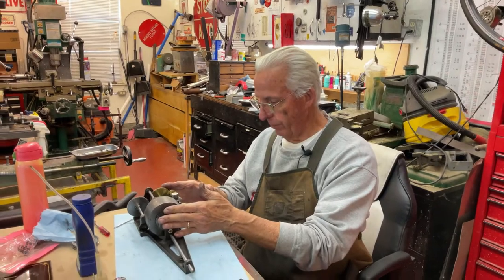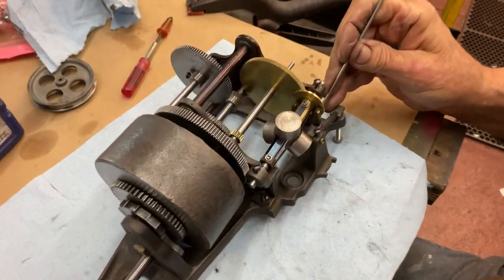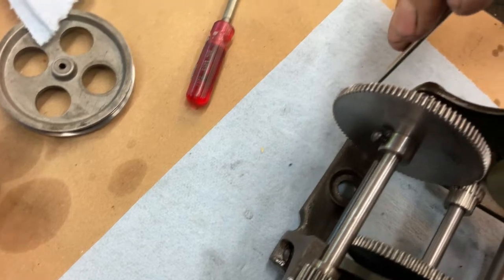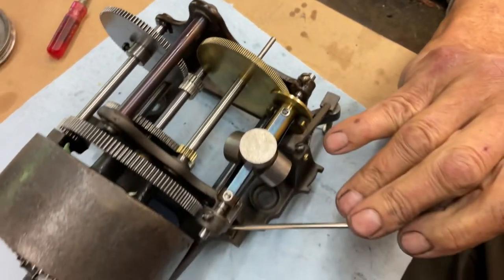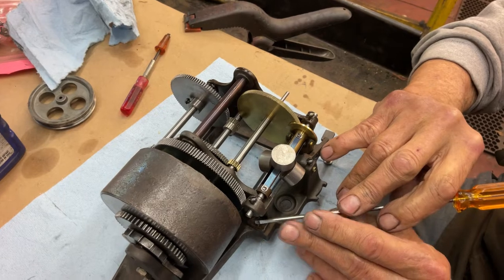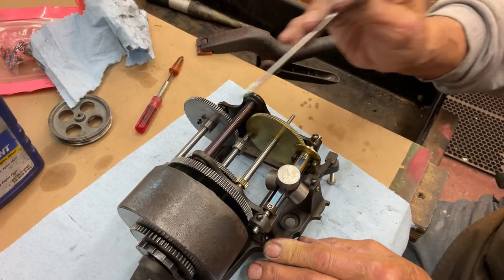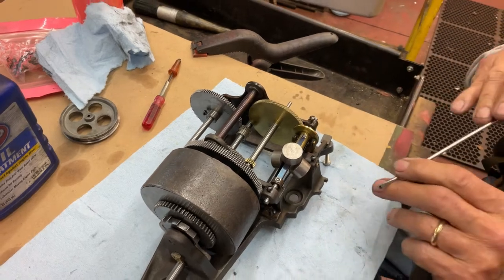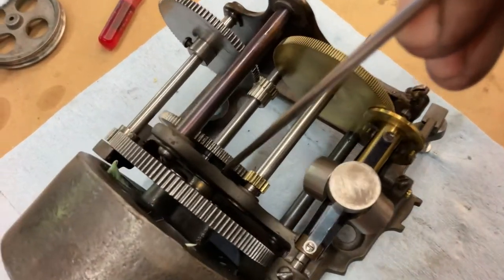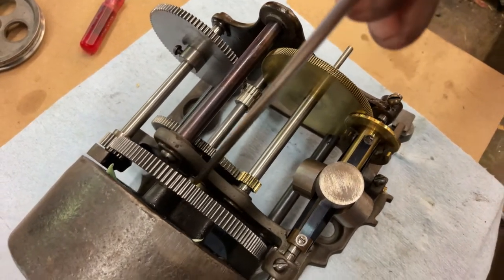When you put everything together and have to put the four screws in, you want to put one screw in here, oil the tip, and then the other screw back over here. Then come over and put this screw in and the other screw in here. Start tightening down — put them in but leave them loose, then tighten this screw down, go across to this screw, then tighten the other two down. Make sure you've oiled the pinion shafts here and here — right where the shaft goes through, right where the spring barrel shaft goes through — and then put a little STP down in here on pre-assembling.